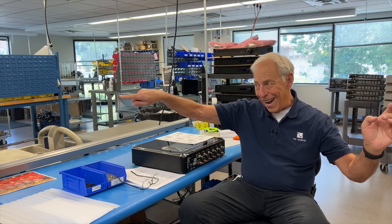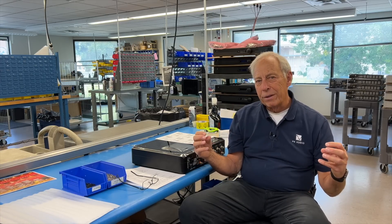Secondly, the power cables — hopefully they're shielded. If you have a good power cable, it's shielded correctly, which means it's only tied at one end: the end where you plug into the AC wall socket. That's where the shield should terminate. The other end, the shield should be floating and not connect up to your equipment — that's done through the third prong.